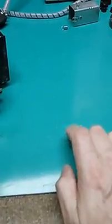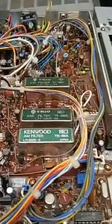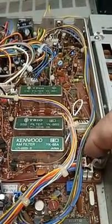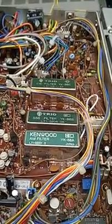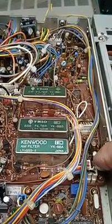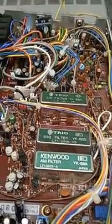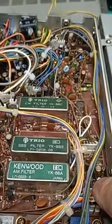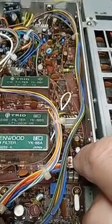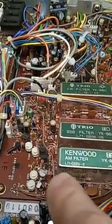Take all connectors off, take the board out — a static-safe workstation is mandatory. Don't try this on a carpeted workbench. Beginning with one corner, locate and unsolder the capacitor nearest the corner and very methodically replace one at a time. If there are a lot of caps, after installing each one I'll put a red ink dot on top, because it's easy to look at a board and miss one. It helps to find the number of capacitors on the parts list and count those removed to make sure none are missed.